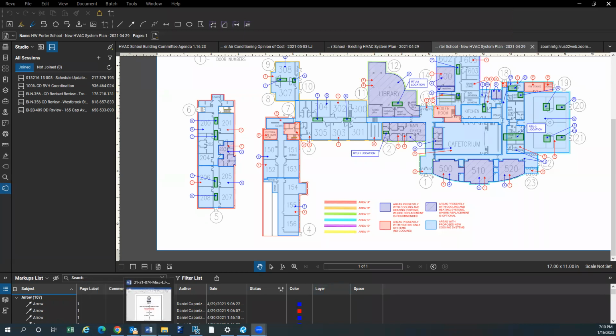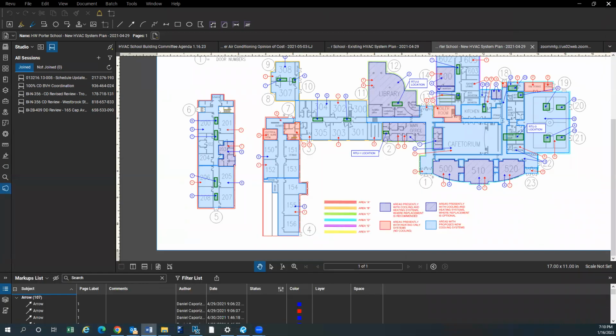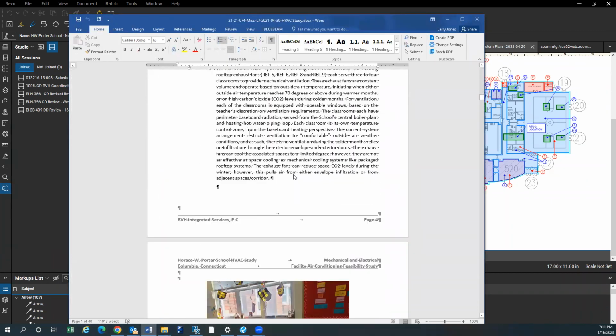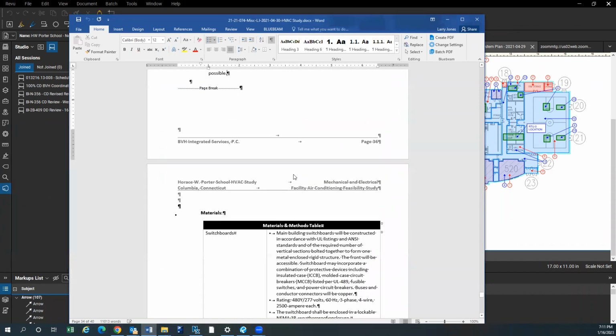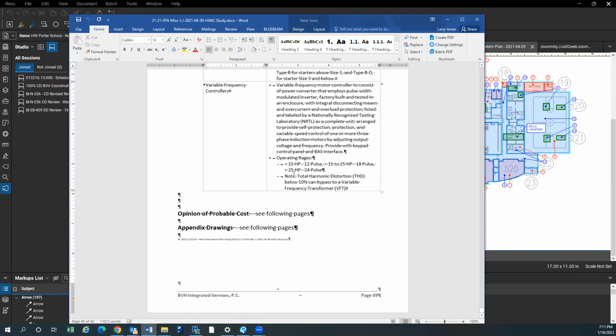Mike, the wire itself, I'm not talking about the switchboard. The actual switch gear is going to have to be upgraded. I know that. But the wiring and the conduit size and everything else that's involved, which is dollars, from the street to the school, would we need to upgrade that necessarily? Yes. 1600 amps is not going to get you, it's not enough to do the entire school.